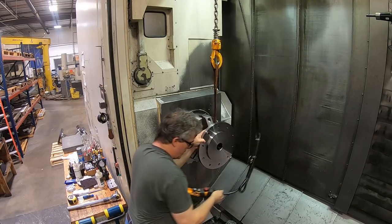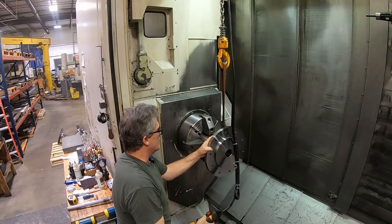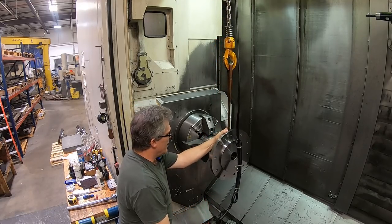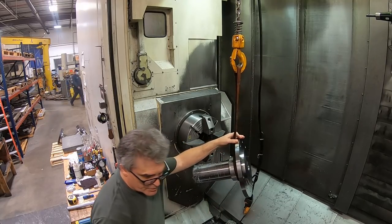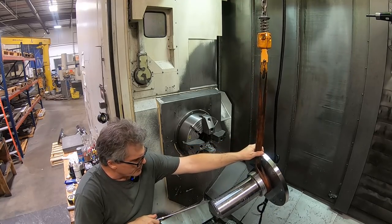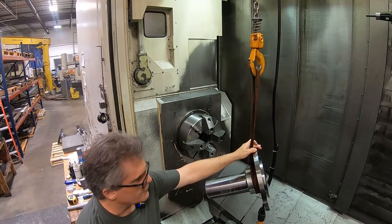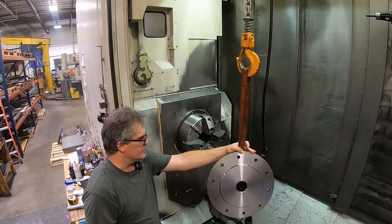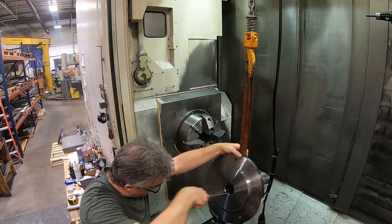But on that same note, they tested both of the hoists, and they passed their load tests fine. Both of my cranes are 2-ton, or 4,000-pound, cranes. They tested them with 125% of that, so 5,000 pounds of weight, and they tested fine.